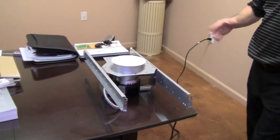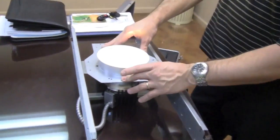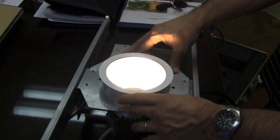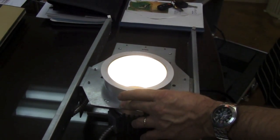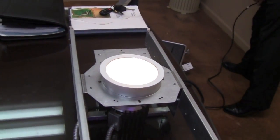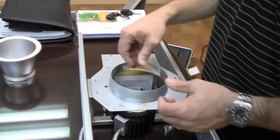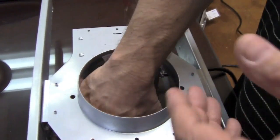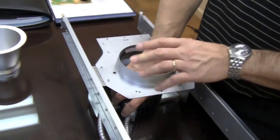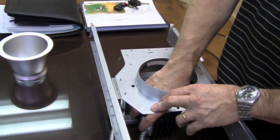This is also built to the most current standards, which says that at 50,000 hours, actually I think this is 60,000 hours, the light level will have dropped by 30%. So extended because it's not directly on the bulb source at all. Actually, this is right with what the industry average is. So when I want to replace this, because I'm now below 70%, we build in the platform so that 50,000 hours from now, you just change this light engine.